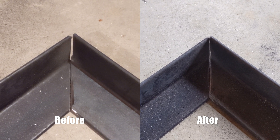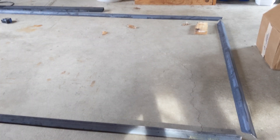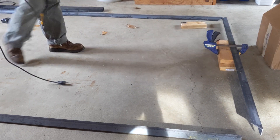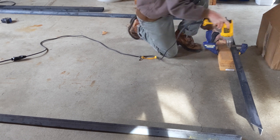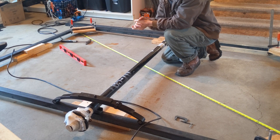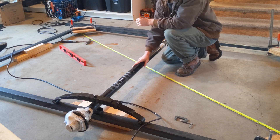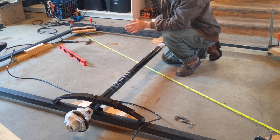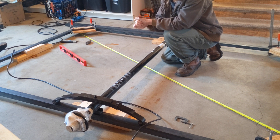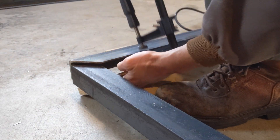Now you can see that gap got a lot smaller. I got this all squared up — the corners have been ground down so they're meeting pretty well now. I think I'm about as good as I can get with the tools I have at the moment. I got this in place just to see that the span is correct. So the current task ahead of me is to get the frame perfectly square and perfectly level relative to its own dimensions.